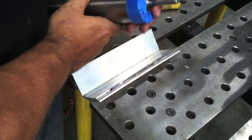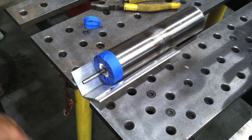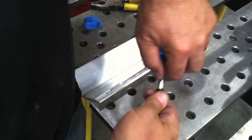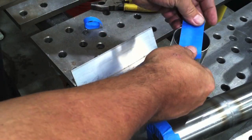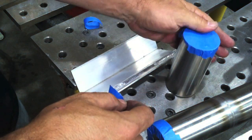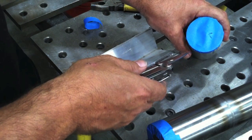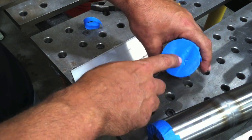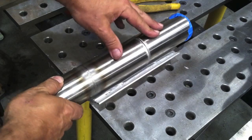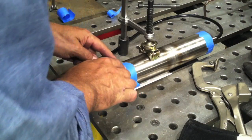I want to get it all taped up. I don't want any leaks because any leaks are going to draw air in and screw up the purge. I need a 100% pure argon purge to make the root pass come out nice and silver. I'm sticking the argon hose on here — this is kind of like what comes on a TIG torch. You can use a lot of different kinds of clear hose, even vacuum hose, but some rubber hoses can actually hold oxygen in the pores, so it's better to use something that doesn't have large pores. I'm taping the other end and putting a little slit in it. The reason I'm putting a slit instead of poking holes is that while it's not welded up I want it to stay like it is, and when pressure builds up a crisscross slit will allow argon to escape while keeping argon in there better when the joint's not welded yet.